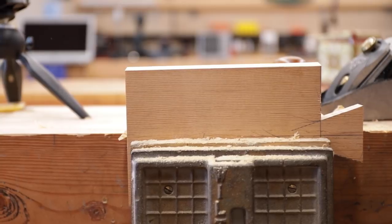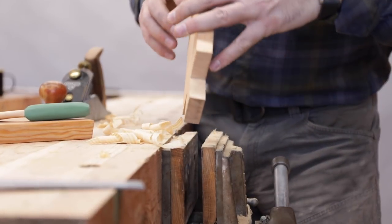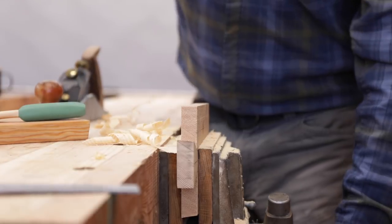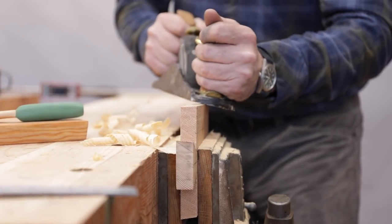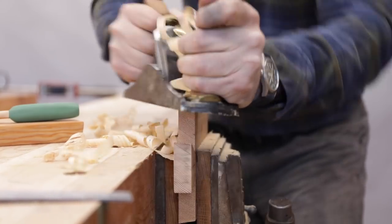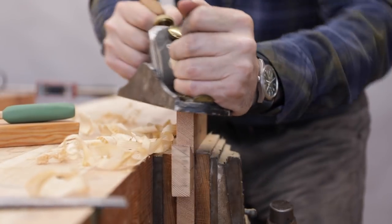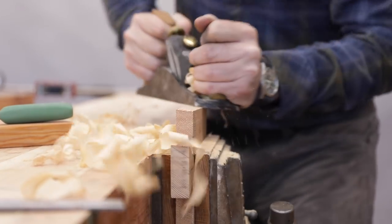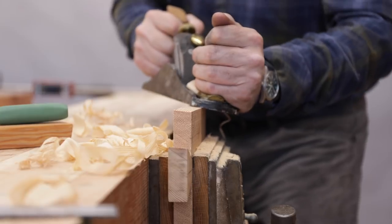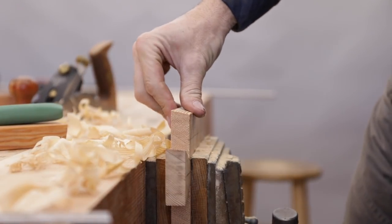That's all it takes — see how nice having that little bevel on there makes all the difference in the world. Make sure you bevel the same way on both sides, so just flip it over and do the other side. I'll just show you how quick and simple that is — turn your plane at a little angle, whatever pleases you. A little bit more, a little bit steeper on the other side.